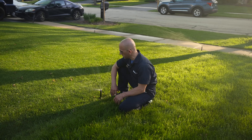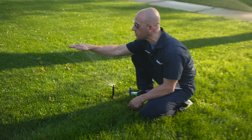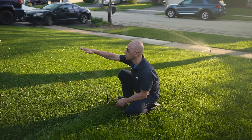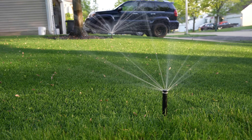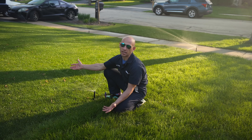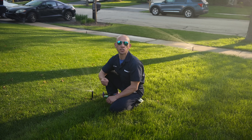The third advantage is the individual streams — each one has a specific different trajectory, covering a set area as the head rotates: one close-in sweeper stream at negative 10 degrees and one reaching out to the full 18-foot distance. These individual streams have also been proven to hold up in wind speeds as high as 25 miles per hour, which is a big deal since most short radius spray nozzles are easily distorted by wind, wasting water that precious natural resource.